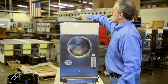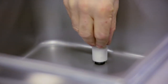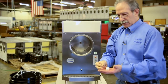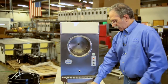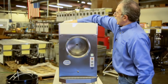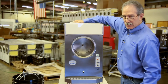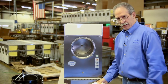You also want to take the float clip off the float up in the hopper. It's a small clip that just snaps on — take it off, slide the float off, and put those two in the soapy water to clean them. Then take a clean cloth, dip it in hot soapy water, and wipe the inside of the hopper out. Get all the residue out until you're back down to clean stainless steel. This is very important to prevent buildup over time.